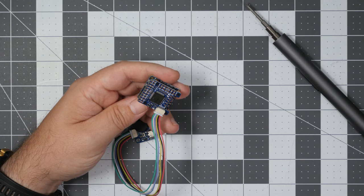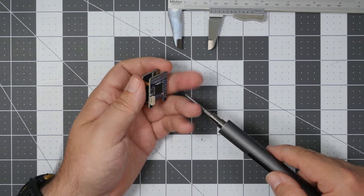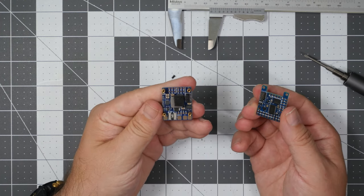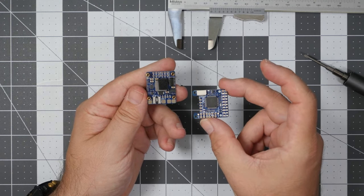We have barometer, we have OSD, we have 16 megabits flash memory for your flight black box logs, five serial ports, three analog-to-digital converters, 12 PWM outputs — so you can connect a lot of stuff to this thing — two-pin I/O ports, and it accepts up to 6S LiPOs. Like all Matek boards designed for fixed-wing pilots, it is a sandwich design with two PCBs. Both parts are connected with a single connector. The bottom one has all the power distribution and voltage stabilization, while the top one has flash, OSD, gyro, and of course the MCU itself.